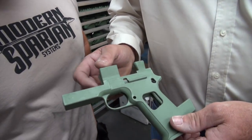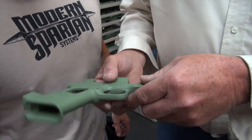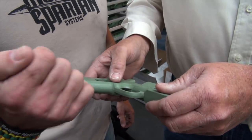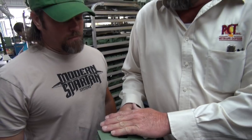On the 1911, this is what you would get coming out of the frame — it's a blank. We have these odd-looking shapes on here which are what we call gates, a means of feeding the metal into it, which will be removed after they're cast. We cast a great deal of detail on the inside: your trigger bow side, the trigger opening, the hammer, the mag release are all cast to size. We have machine stock on the outside so we can do multiple variations of the weapon.